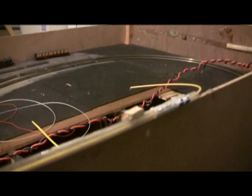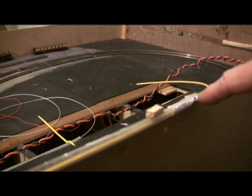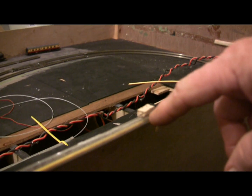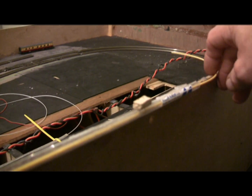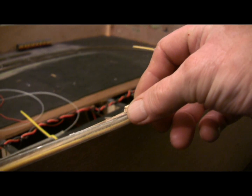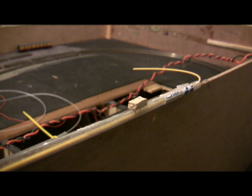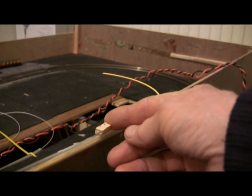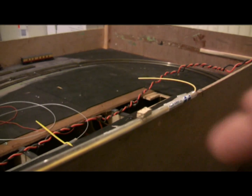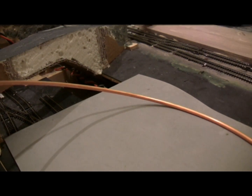If we come back up to the slider bar, rather than having a solid metal tube, I decided that there's no reason why you can't have a plastic tube, which is very easy to cut. A couple of pins through the strimmer cord into a little bit of timber, and that becomes your slider backwards and forwards once you've cut a slot in it. So as you slide that along, it obviously pushes the strimmer cord along the plastic tubing. The reason I've used copper obviously is so that it is stiff and stops in place, again just as a demonstration.